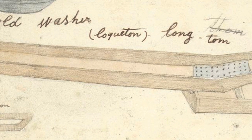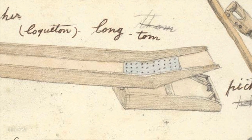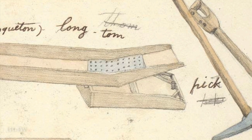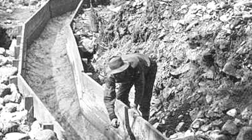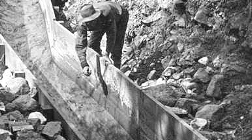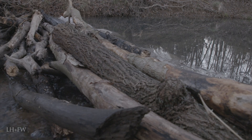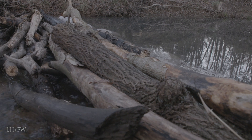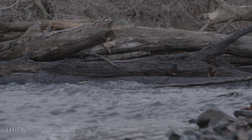The long tom and the sluice were the last methods that could be employed by a small operation of miners. The long tom was much like an expanded rocker, often having a 10 to 20 foot trough, though unlike the rocker box, agitating of the pay dirt was not done by hand but by gravity and the force of running water. The length of the sluice was dependent upon how refined the material needed to be, and they were often linked together and could be many yards long. Miners would often dam and divert streams great distances in order to direct the constantly moving water needed for the sluice to work.